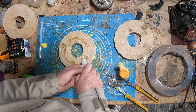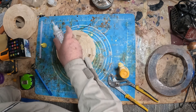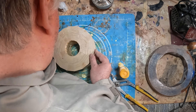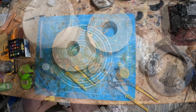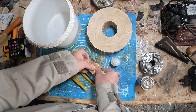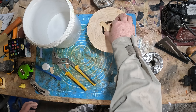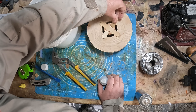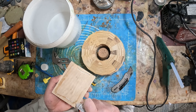The base rings were next. I used super glue on these because I'd be pouring a resin core on the same day — if I used Titebond I would have to wait another 24 hours before casting. Once they were glued I added a piece of sapele to the center core, deliberately undersized to form a resin border. I used mixing sticks and super glue to hold it in place, and also added a piece of plywood to the base to seal the void, held in place with super glue and hot melt glue so hopefully it wouldn't leak.